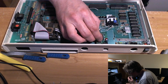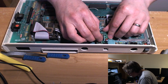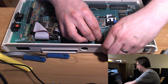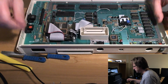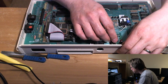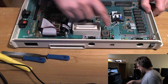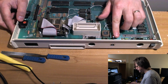Hopefully this should work out okay. This is going to be glued to the main board, and when you put the motherboard into the machine, I want it so that it wedges, and the USB connector just pops out through this hole in exactly the same way as the SIO connector does. So it's obviously going to have to be a little bit more loose, but that's what we will end up with. And then we just jumper everything across the SIO connector.